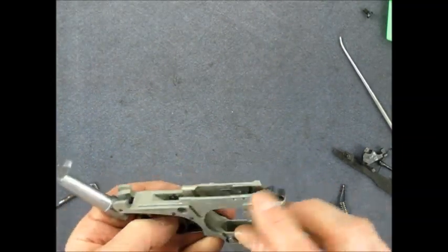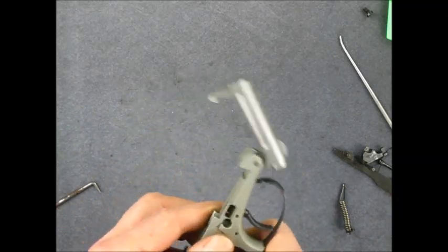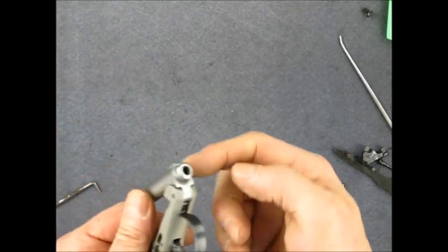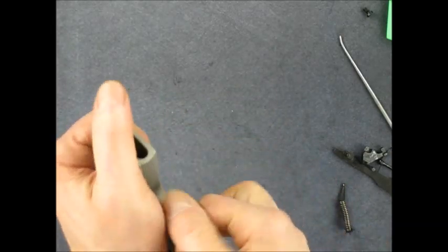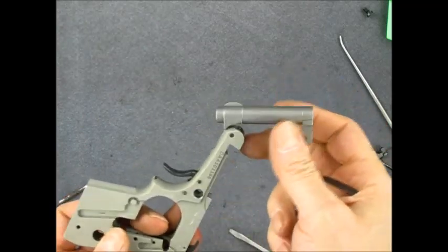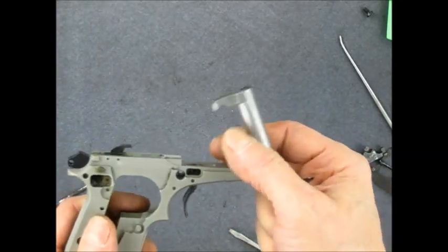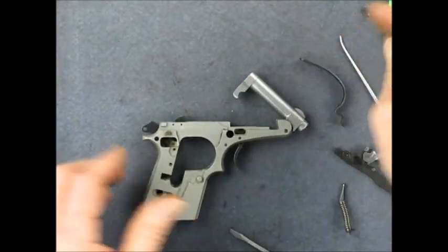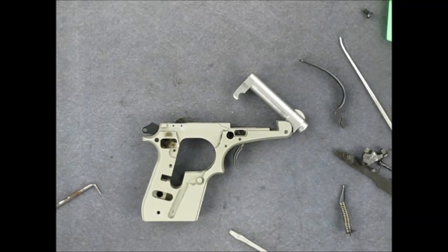I imagine the hammer comes out of there too — that pin feels pretty tight and you'd probably have to drive it out. I have no need to do that. One other thing: this trigger guard also serves as the barrel spring. Get it in the spot where there's the least amount of tension on it, grab it, and pull it out from the back — and it comes right out. There's also a pin here that holds this barrel, so I suppose you could take that out by driving that pin out, but I'm not going to. I think that's enough for this video. These parts need to be cleaned up, so I'm going to shut the camera down and we'll be back later to see if we can get this thing back together — hopefully it still works when we're done. Thanks for watching!